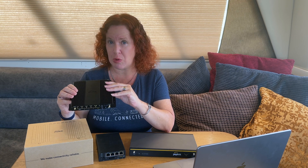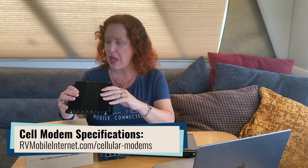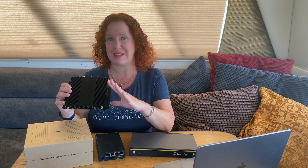What we love about this is it does have dual modems and they are Category 7 modems. CAT7 is the new minimum LTE modem that we recommend, and it does have full support for all three of the cellular carriers — T-Mobile, AT&T, and Verizon — covering all of the important LTE frequency bands. It has carrier aggregation for upload and download, making it a great performing, solid LTE modem that will be future-proof for quite a while to come.